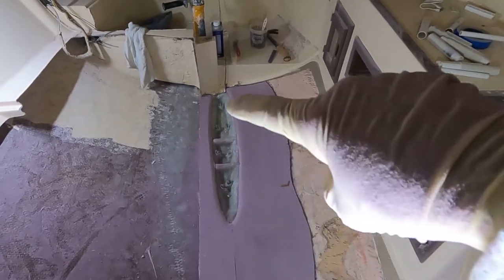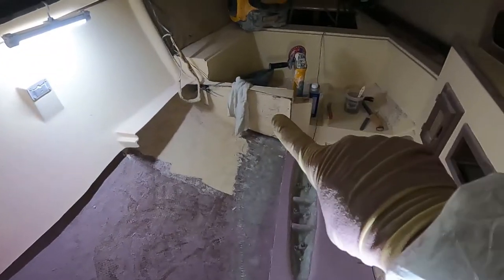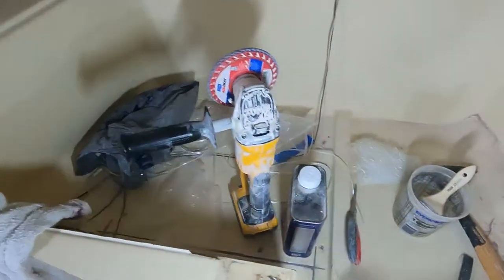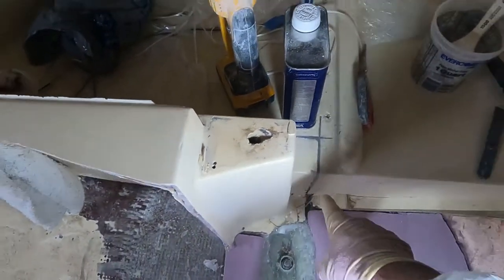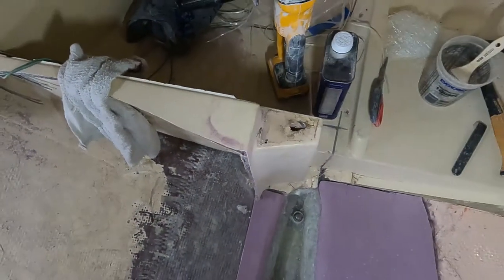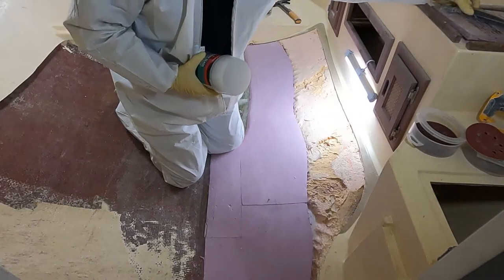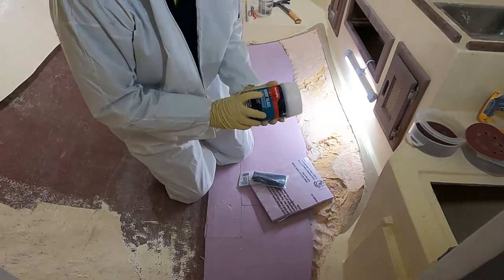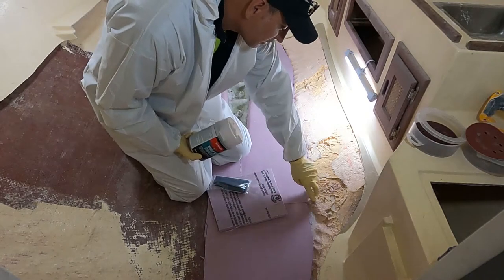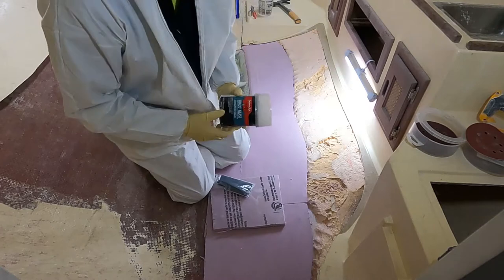Next I'll add filler around the keel area, sand all this, then put the original flooring back in. You can see the compression post — I've already put that in, used biscuits in between the joint all the way around, and bedded that solid on the hull to make it very solid and secure. I'm going to use Bondo Glass, which has fiberglass mixed in with it — it's more of a fiberglass resin than Bondo — to fill in these voids so there won't be any before I put the fiberglass back on.